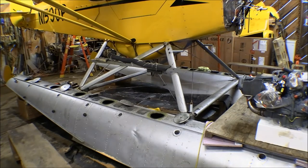I pulled the hatch covers off of the floats and it's pretty much what I expected. The front compartment is dry — it's got cobwebs in it. The rest have a little bit of water in them, but that's just residual water from what wouldn't pump out last fall when I took the airplane home. I pumped the floats out before leaving the dock. That's actually a good sign because it means it didn't drain out over the winter, which means there are no leaks in the bottoms of the floats. I'll get those sponged out and dried out and inspect each one to make sure all the bulkheads and ribs in the bottom are in good shape, and then go over the bottom and look at it. But I think I'm going to quit for the day — it's 7 o'clock.